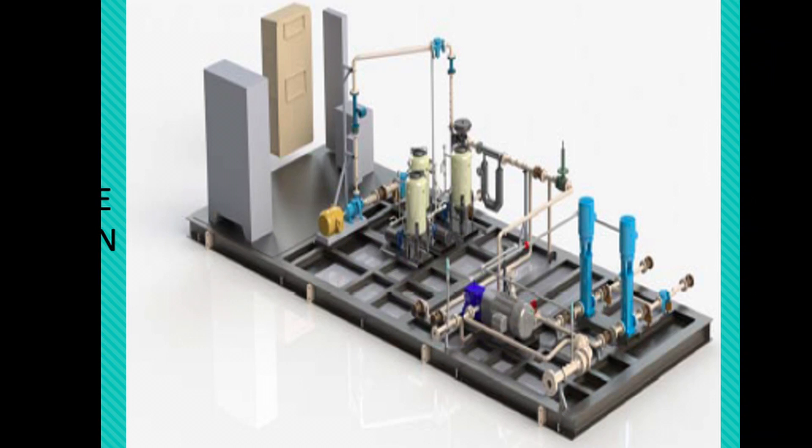Final inspection and acceptance of the installed structure: a request for final inspection cannot be submitted until all structural modifications, preparation, and touch-up are finished. There must be a walk-down punch list compiled with both parties formally. Approved quality checklists and documents with all relevant inspection and test reports shall be collected and forwarded to the QC department after final inspection for handover. All construction punch list items must be rectified; items not affecting structural safety may be left until acceptable for final mechanical completion walk-down. The turnover team will coordinate to create a subsystem of the scope prior to mechanical completion walk-down.